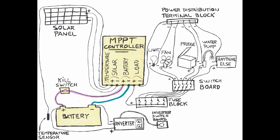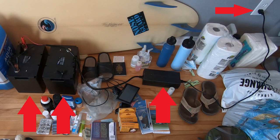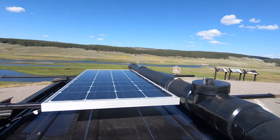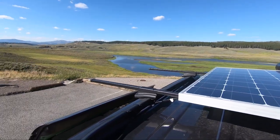First thing to connect is the battery. But previously, the battery must be fully charged with the use of an electric charger using wall electricity. The solar panel must not be connected first to the MPPT controller. This would damage it. The battery must be connected first.